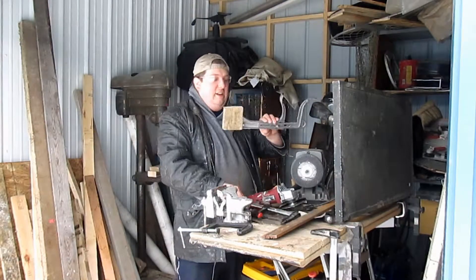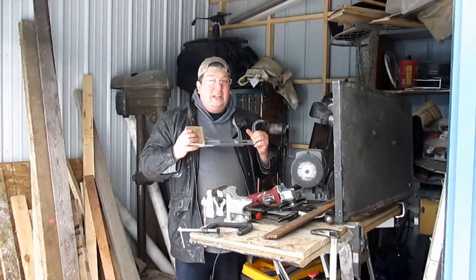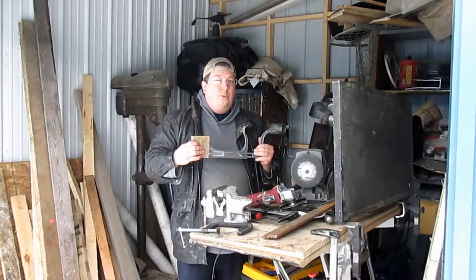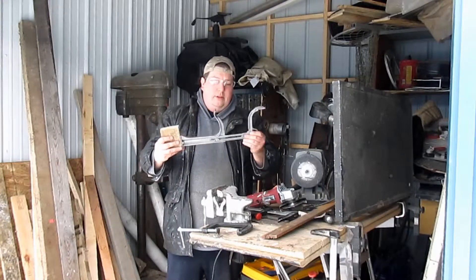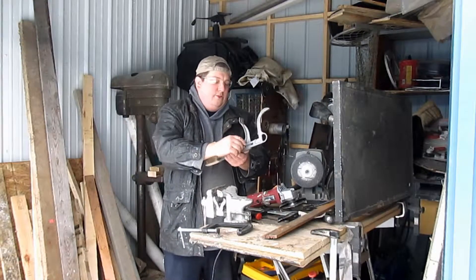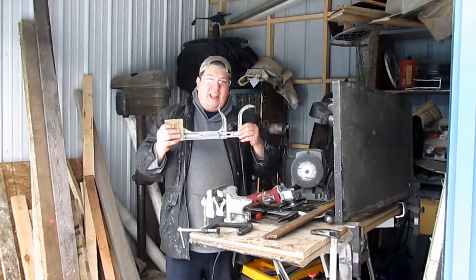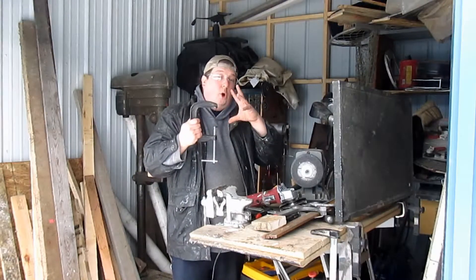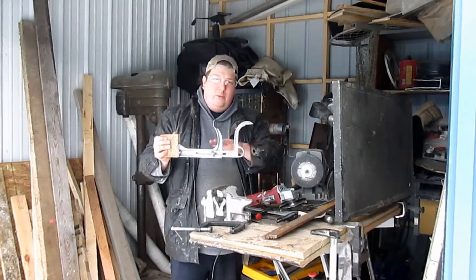I found this one — the price tag was $2. I prefer hardwoods; I use a lot of oak because with the pallet buster I can get wood pallets for free, so really nice hardwoods can literally cost you nothing. What you need is something adjustable that can hold in the X and Y direction — a clamp that can extend and then lock into place, as opposed to C-clamps which are great for holding something in place.